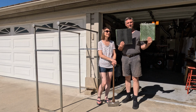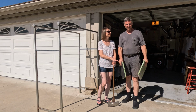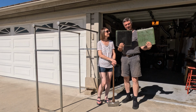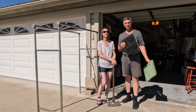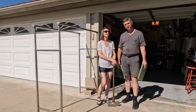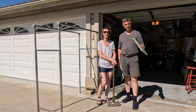Well, as you can see, our fiberglass versus basalt test went really well with our axe, which was a lot of fun. And we did find out that our basalt is a tiny bit lighter, and it's more resistant to flexing, and so we get a stiffer hull, and also slightly more impact resistant than the fiberglass. So that worked out really well. And we also finished fairing the hull, the first layer at least, with our very own special technique. Yes, we did come up with that because we have these flexi tools, so it made a difference. So we changed up a bit because of those tools.